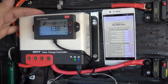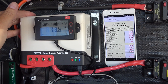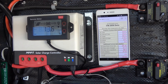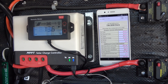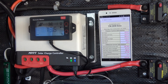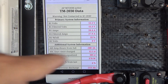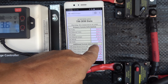People ask why I have too much wattage going into this — you could put in a bigger controller and get more current out of it. But what I'm doing is over-paneling my roof because most of the boondocking I do is in the southwest where you have short winter days and low sun angle. I also do a lot of boondocking on the west coast under trees and clouds, so I really want to harvest more solar power. When I'm in a low-angle situation or not getting full sun, I'll still be able to max out this controller. I've got three lithium batteries over 300 amp hours of capacity, run down to minus 200 amp hours — about a third charge — so there's lots of room to charge them up.